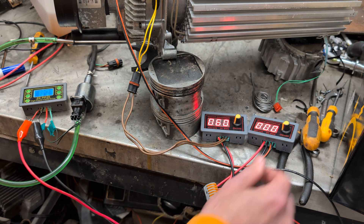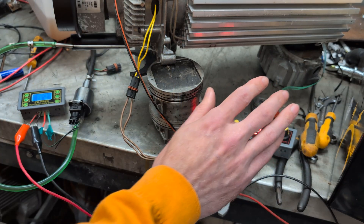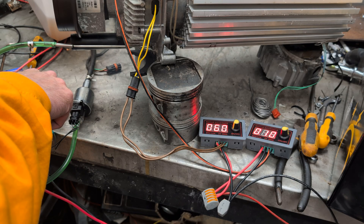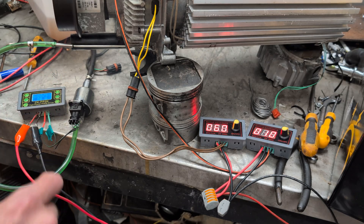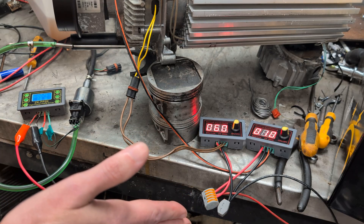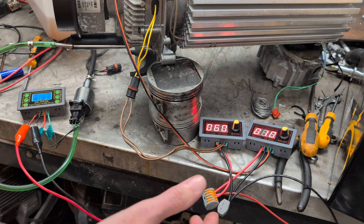That's not been 30 seconds, but I'm just going to do it anyway. Set this to about 10% — that was already on. So that's blowing in a little bit of air. Then we come back and we'll turn the fuel pump on. I've currently got it set to 25 milliseconds on and 800 milliseconds off. We'll start running that and then we'll see if we can hear when it lights. You hear the whomping? Okay, there it goes — it's starting.